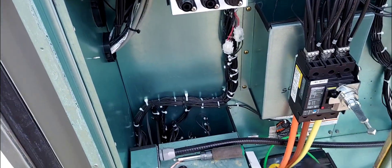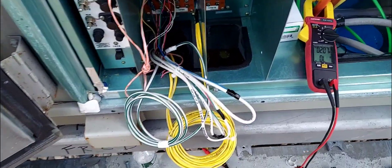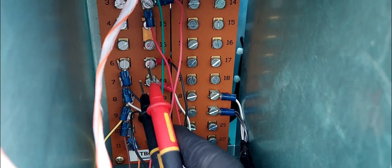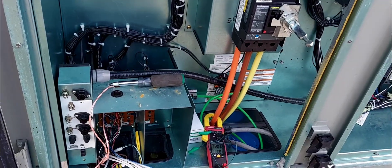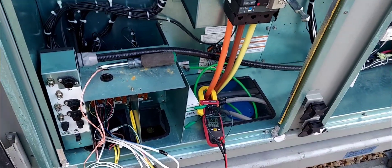Is it a problem or are we off from control? Let me check real quick. I'm going to check my external stop points — DC volts. The video I'll be uploading before this one will show how to troubleshoot this. Checking my points now — I'm getting 23 volts DC. That's the reason my test was aborted: the machine went off an external stop. The external stop switch or controls decided to turn this machine off.